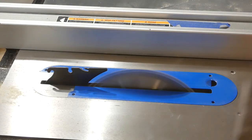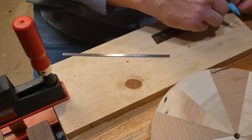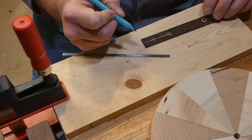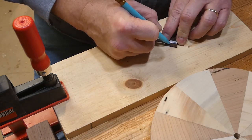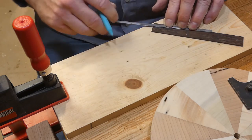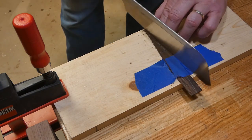I really didn't want to use the cheap little metal hands that came with the clock. I like this really dark African wenge — it's almost black in its coloration. I had to cut it very thin; you can't make the hands heavy at all or they won't turn. So I cut the wenge as thin as I could, then took some measurements and cut out little wedges. The hardest part was drawing it up and making sure the point was in the center of the wood. You can't really use power tools when it's this thin and small, so I had to use the handsaw to get it started on the line and finish the cut.